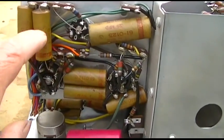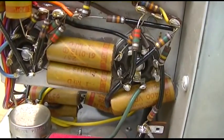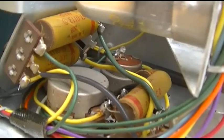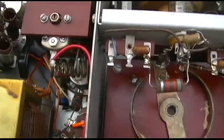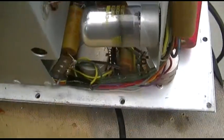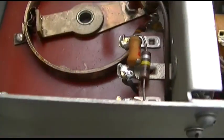I'm sure these are bad and are mostly causing it not to work - nothing special, 0.25 at probably 600 volts, a whole bunch of them in here. I wonder where the six kilovolt capacitors are for the sweep. Looks like it's got a loctal tube in there. I wonder what this thing is right here.